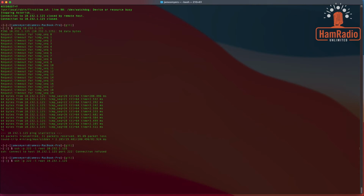Oh, here's what changed. Remember I changed that port to 22 rather than 222? So I can now remove this because 22 is the default. And we should get right in now. There we go. And log back in with our new password that we just set.